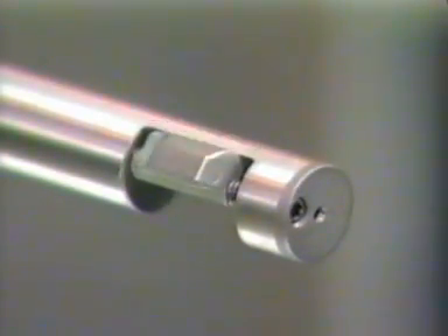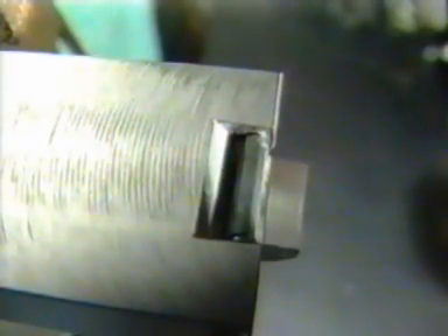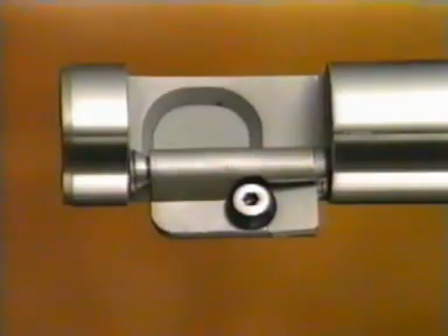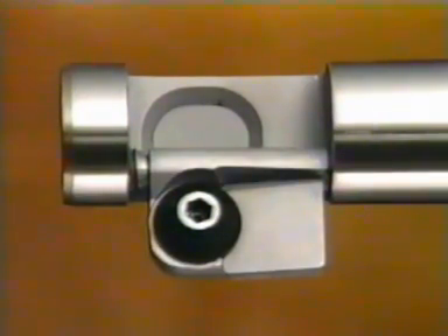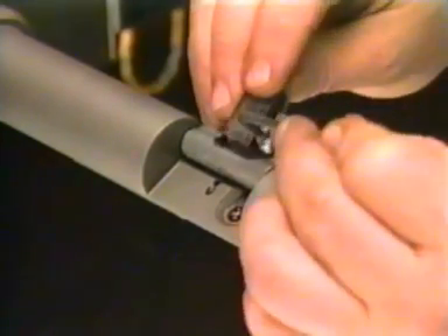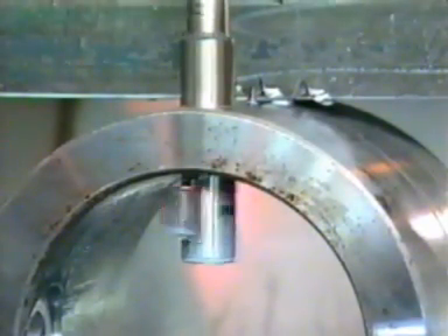Front and back spot facing, chamfer, and radius operations require just a simple wing change. Wings on smaller Erex tools are made of high-speed steel with cutting edges ground on the wing, and may be re-ground using a grinding fixture available from Erex. The larger tools with spindle size 12 millimeters and above use square indexable inserts of type SPUN 080208, 090308, 120308, 150412, and 190408. In many cases these tools can also be equipped with center lock inserts. Rectangular inserts are available when a square cutter cannot fully cover the face dimension. Should your workpiece material require flood coolant at the cutting edge, Erex tools are available with coolant through the spindle.